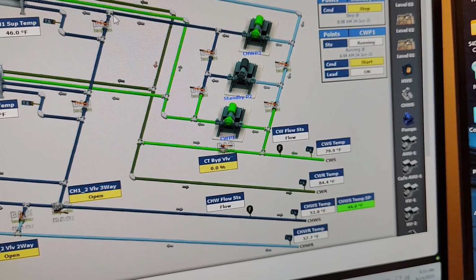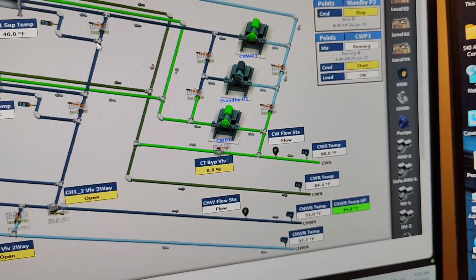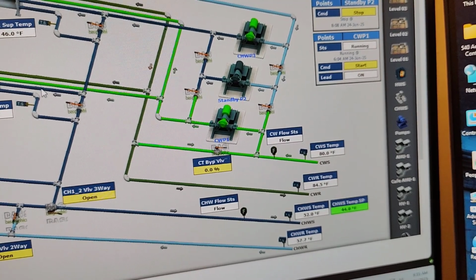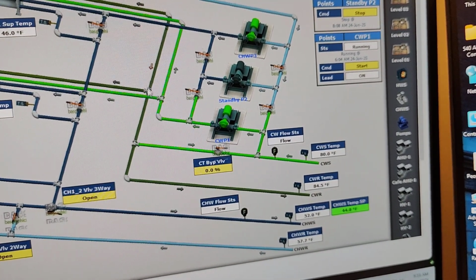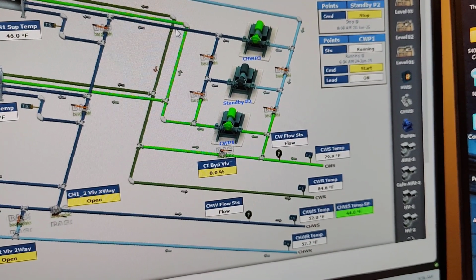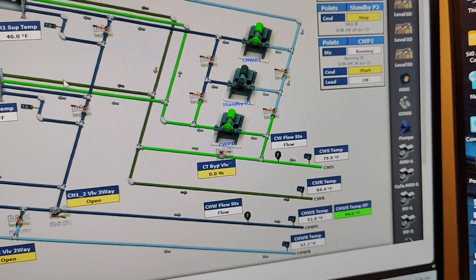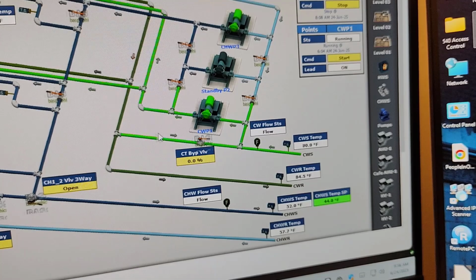Okay, this is the line. It is going here. This one is open, not closed. This one is here, and this is closed for chiller 1, but it's continuing. Okay, this one, sorry, we are here in this line. This line is for chiller 2. It is going this side. This is coming also from chiller 1, but this arrow is here, so it's going from here. This one is closed here, so it's coming from the condenser water return. It is going here to the condenser water return. It returns here.